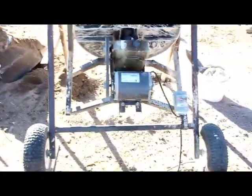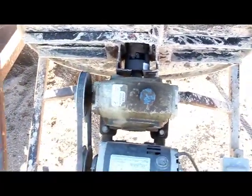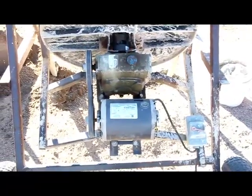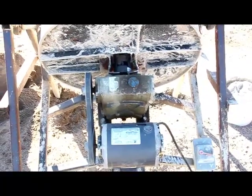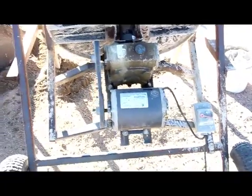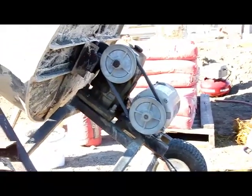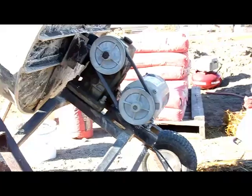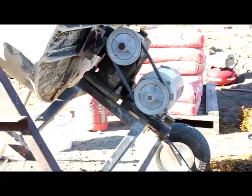It's going to continue to work hard for years to come. The most expensive thing on here was the gear reducer — we were lucky enough to get it on sale for about 50 or 60 bucks. If you have access to combines, swathers, old balers, or anything with a PTO on agriculture equipment, chances are you'll be able to find a gear reducer. The long and short of it is you need to produce something that spins at 30 RPM — 30 is the magic number. Any faster and you'll have a mess of concrete everywhere; any less and you'll be waiting forever for it to actually mix.